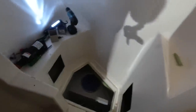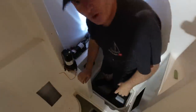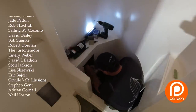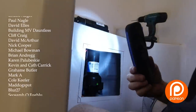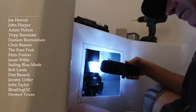I've got a really nice little spot in there for our water pumps — a 22-litre-a-minute unit. It's a pretty nice big unit but the hole's not big enough to get a drill or a screwdriver through it. We had both of us down in there a minute ago and it was a bit tight. I went back in, got it mounted, and it started to wobble — didn't want that either. A long time ago I put in some nice mounts in here but I failed to factor in that I wouldn't be able to screw them in or drill them for that matter. That's one of those things — access. I'll work it out.